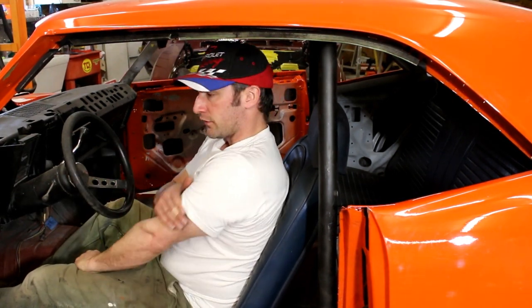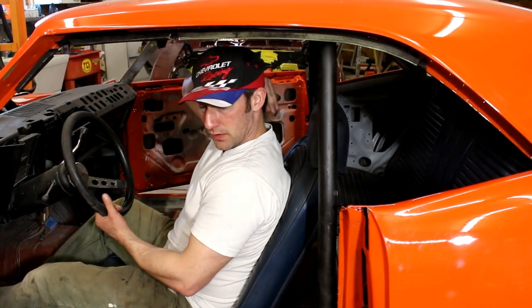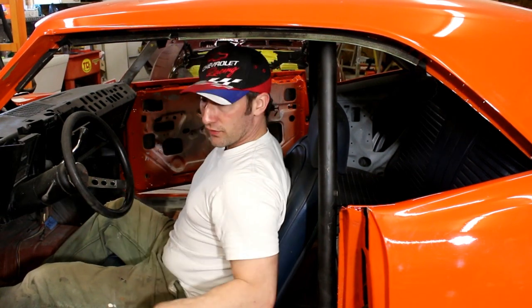This hoop and this roll cage is, especially with custom, this hoop isn't a great example. This is a pre-made kit bent up for the most part for this type of car. Still has to be trimmed to fit. So I've put the back seat in and I've temporarily put this seat in right now, mainly just to check my fitment of this main hoop. The plates are all welded in. The hoop is touching the headliner right now. It's actually tight to the headliner.